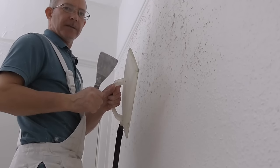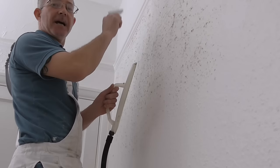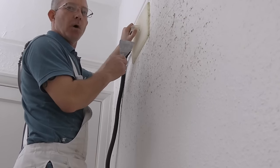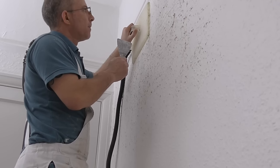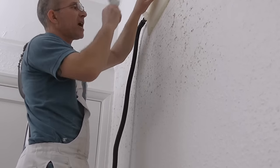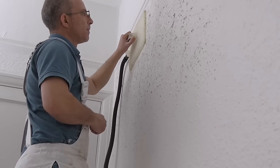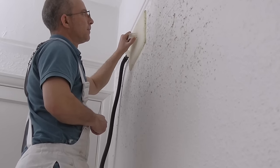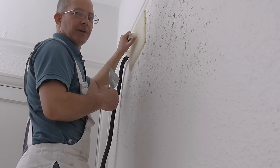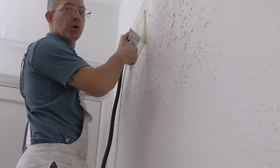You've got to be really careful with this because of the boiling water. Best to lay it to the top and never keep it on the wall too long. You can move it about a little bit at the beginning just to get a section warmed up. If you're ever using these on plasterboard you're going to have a problem half the time because the plasterboard will just delaminate if you hold it too long in one place.